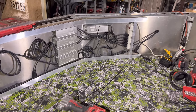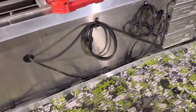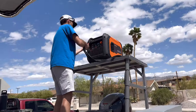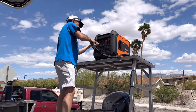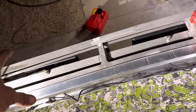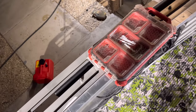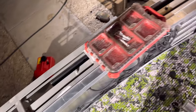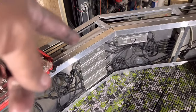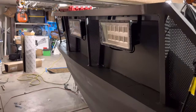The easiest way to control these lights is to plug them all into outlets — one for each side — then link them together. The outlets go to a splitter, the splitter goes to a heavy extension cord, and the extension cord goes to the generator, which we'll get to toward the end of this video. We could have hidden the power supplies in a lower-profile cylindrical block, but accessing or replacing them would have been very difficult. This double wall is completely serviceable once we make the bend on the brake.